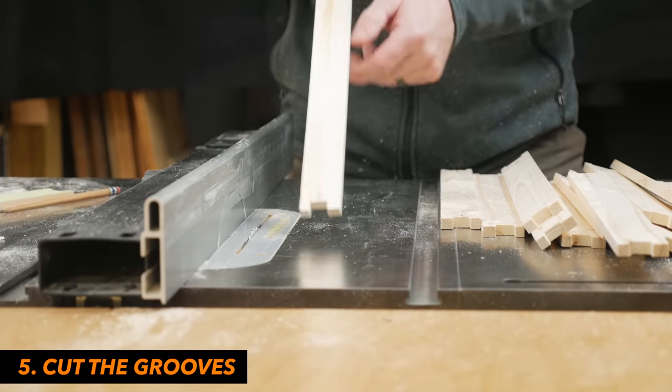This is two eight-foot two-by-sixes worth of sidebars. I had some waste — some didn't come out right — but this is the hardest part of the bee barns right here. Making these things is the most tedious and difficult part, so once you're here, we're in the home stretch. The next phase of the project is to make the little blocks that hold the foundation in place. When I made a hundred bee barn frames two years ago, I made these little figure-eight shaped blocks by hand, one at a time — 200 blocks total — which took about a day. I figured out a better way, and I'm going to show you now.